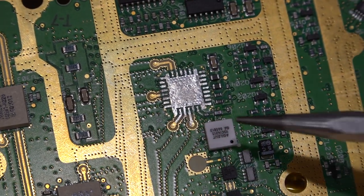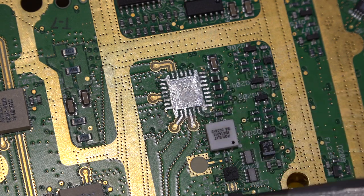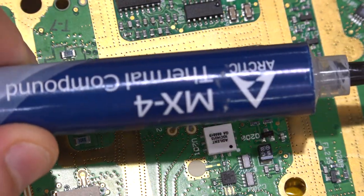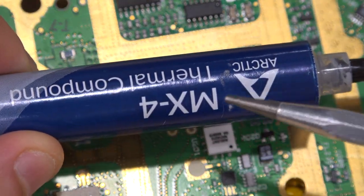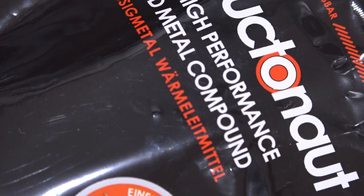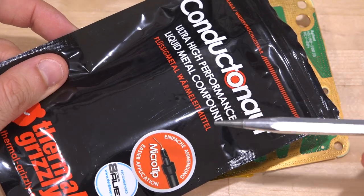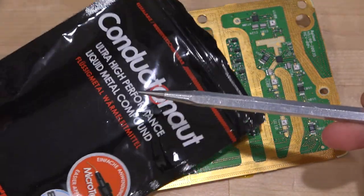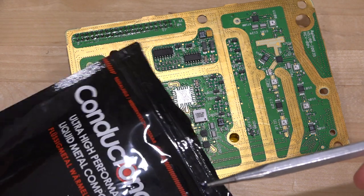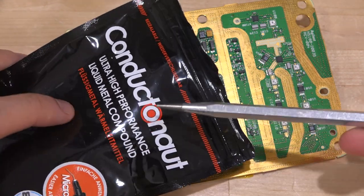We can't do it this way, so I have to find a way of attaching this where we get a good thermal connection and a very good solder on the outside. A thermal paste is out of the question — these have far too high thermal resistance to be able to take the heat out. The next thing I considered was liquid metal. Liquid metal is a very interesting topic. These are eutectic metals — a eutectic compound combines two materials that are solid at a particular temperature, and when you combine them they become liquid and go through a phase change at exactly the same temperature.